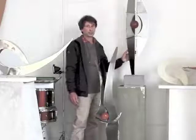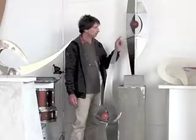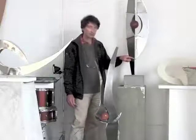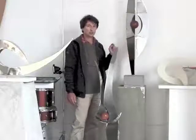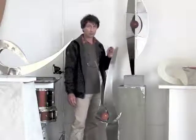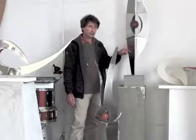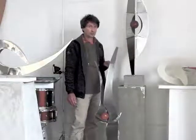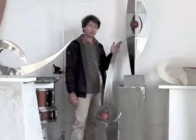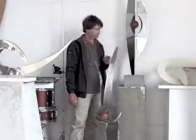Edges on a piece of stainless sculpture are very, very important, and the way you define your sculpture is largely via the edges. I use a method known as TIG welding, which proceeds literally bead by bead — like a small blob of weld — and the weld proceeds forward. It's quite slow, but this is the only way to do it. Then a whole series of grinding processes take place, from coarse to fine and smooth, to literally grind off the weld and finish it to the desired finish.